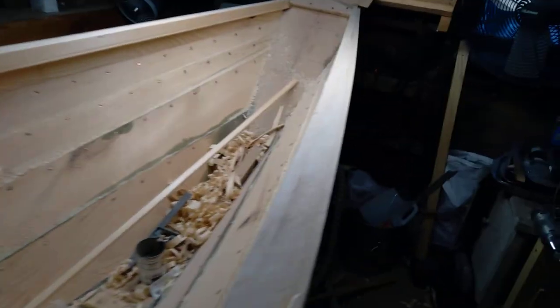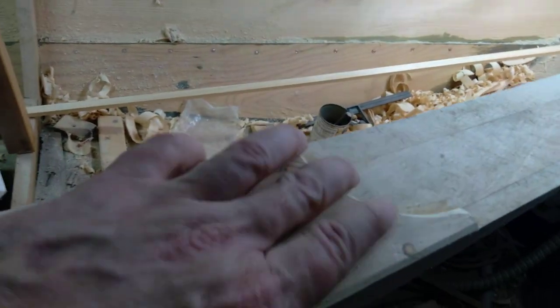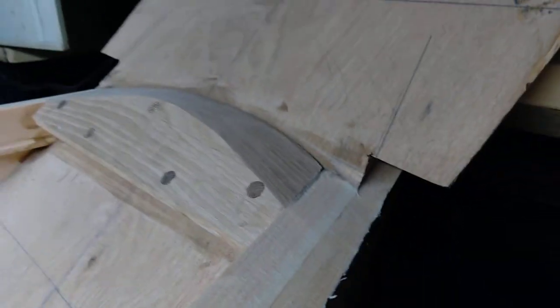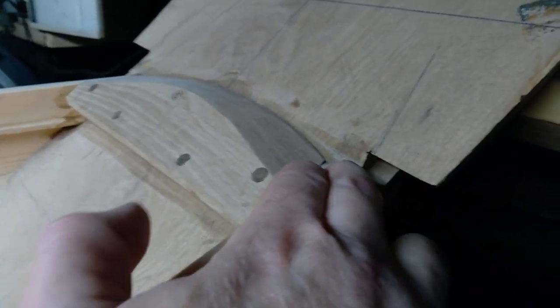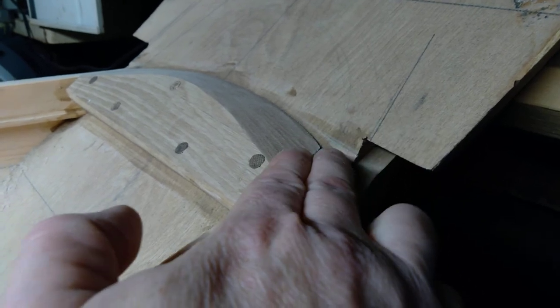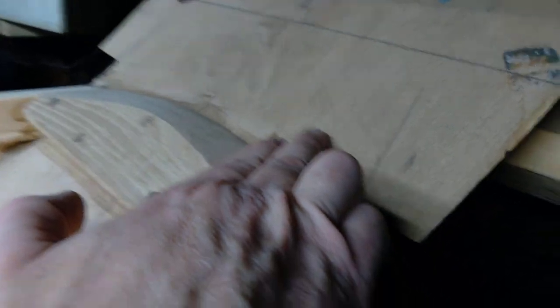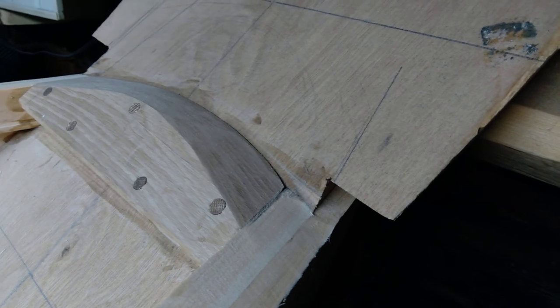So next video, we'll be back here at the transom. We've got to do the same thing. Marry the bead stock into the end of this rail cap. And then back here at the transom, the bead is actually run past the transom. So we're going to need to cut the transom in a tiny bit, I believe, and then up. So it's going to come in, and then the edge of the transom up to the height of the bead. And then that's where we put the round in the transom. And there's going to be a sculling notch in there as well. So anyway, something for another video, because we're pretty much out of time on this one.